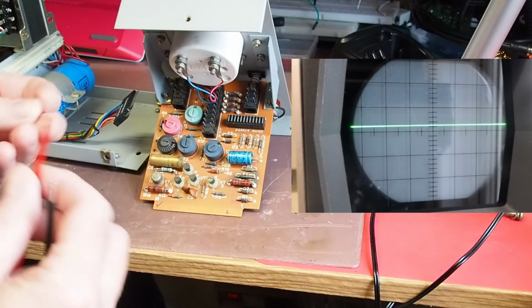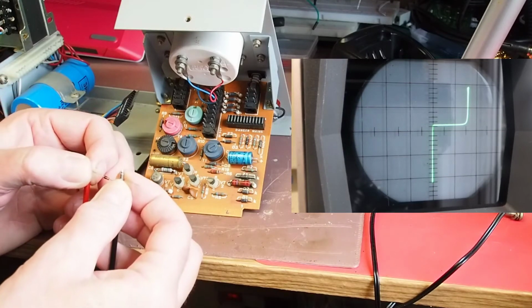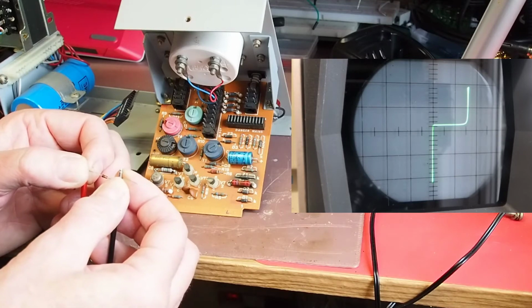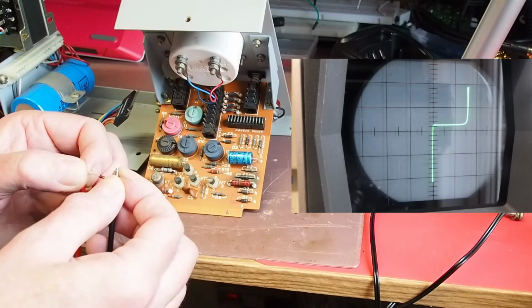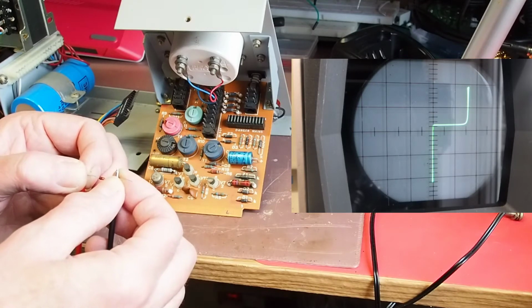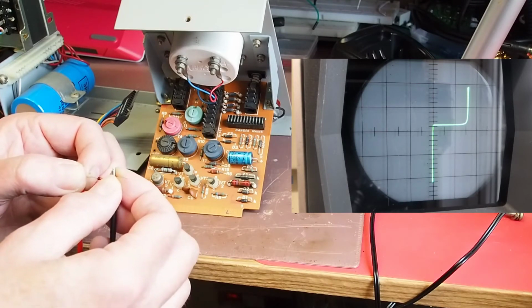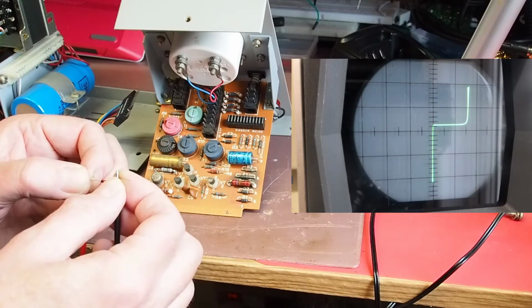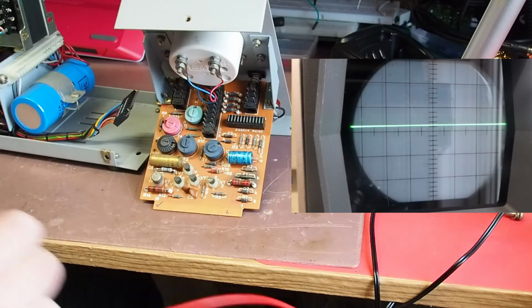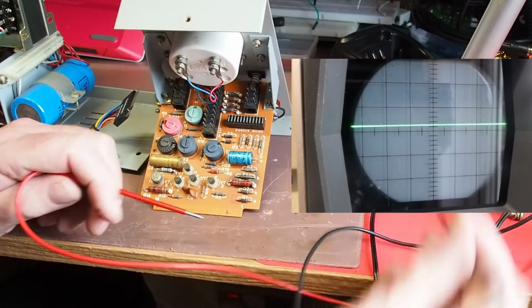This is a Zener diode, and with the Zener diode we get that very distinctive shape. We would get one of those knees, the one that goes down, you'd expect with any diode, since that's the forward bias voltage, but the other knee is the Zener's voltage. In this case I think it's a 4.7 volt Zener, and the distance that right hand knee is away from the center gives you an indication of the Zener voltage. So what I'm going to do is just try testing it in circuit, and I've had a quick look at the traces. I've been struggling to get a circuit diagram for this.